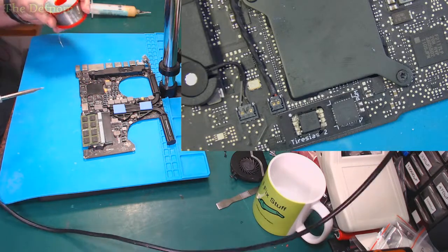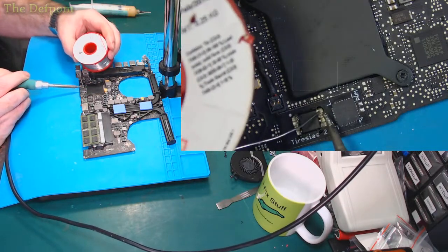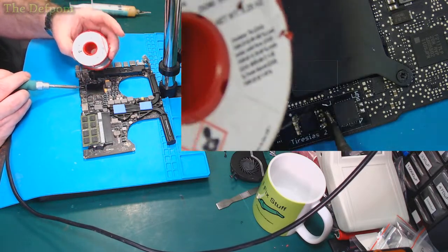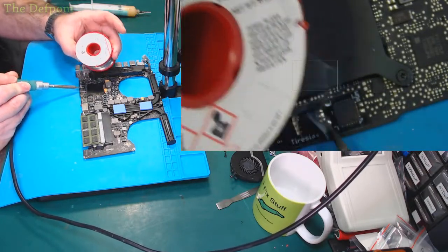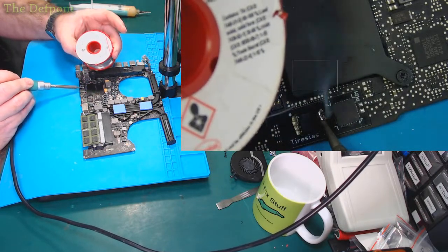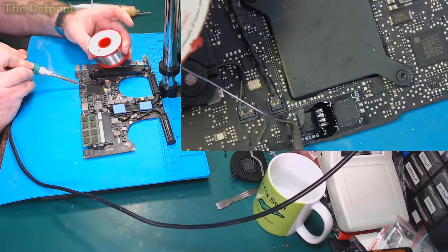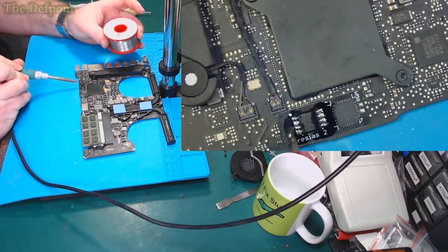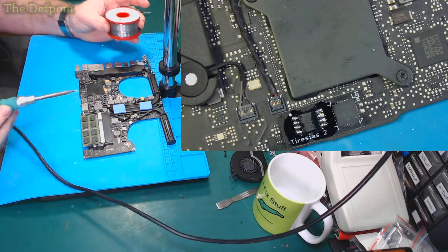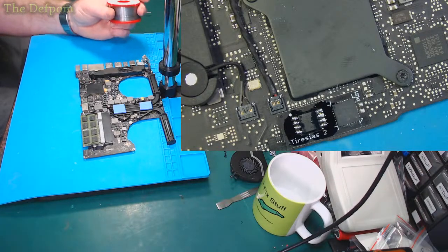Right. So we'll just solder this down basically, hopefully without blocking the camera shots. Drag soldering. Okay, that side's done, let's try this side. The tricky thing is to make sure it's bridged across each of the pins correctly, because sometimes it doesn't quite bridge across. Though today it's looking like it's behaving. That might be done already. That's looking pretty good.